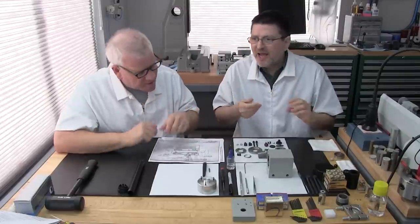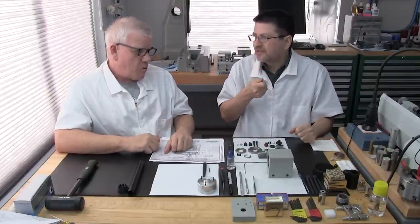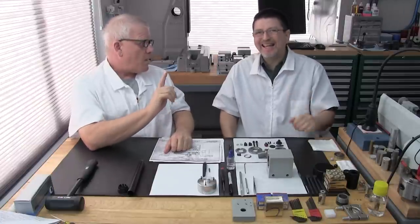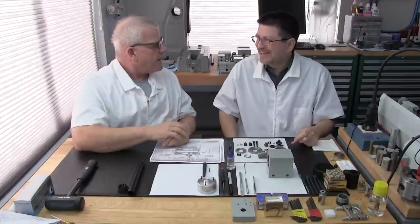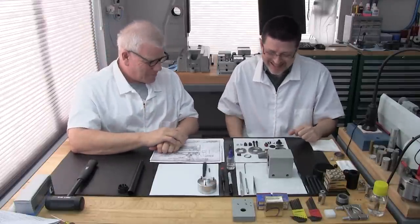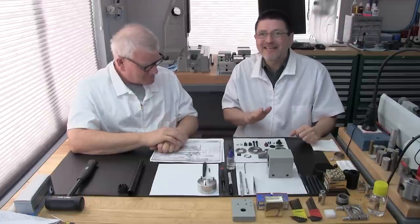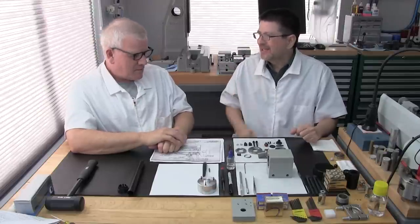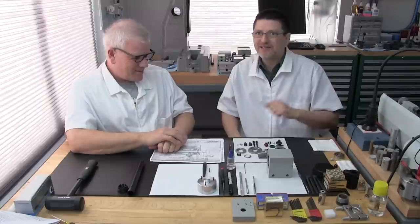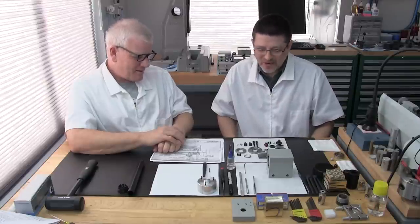When you're using the lathe all day, changing a collet, you get into a rhythm. You lock the spindle, change the collet, and sometimes you forget to unlock the spindle. That never happens here, but I've heard and read stories about people leaving that engaged and then turning on the spindle. It's nice that it's red, like a warning: don't forget to pull that out before you hit the speed control on the motor and start it.